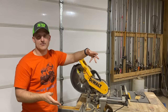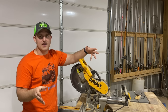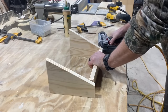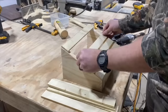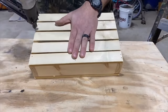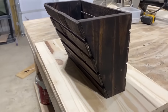If you only have small pieces of scrap wood laying around and you need just a little bit of storage, try making a hanging basket. These are really similar to the crates but they actually hang on the wall, and they're really easy to make. Depending on the scrap wood I have laying around, I can make one of these in about 10 minutes. An 18-gauge brad nailer helps, but regular finishing nails work just fine. For this particular hanging basket, I used strips of lattice to make the sides, but you could also rip up 2x4s or other dimensional lumber. The flat side allows you to hang it on the wall — a great place to hide all your junk when company comes over.